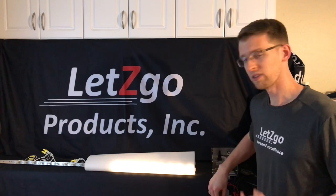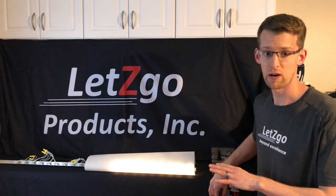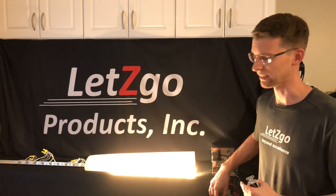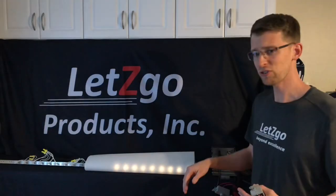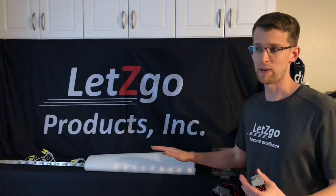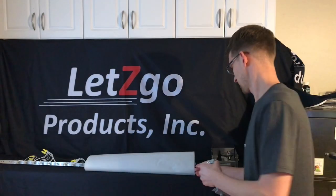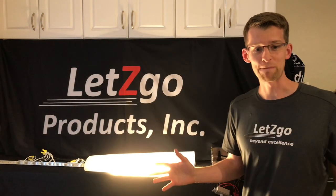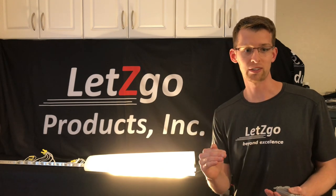When I turn these lamps up right now, there are nine of your standard average power factor lamps. As I turn this up, we're going to get to a point where you're going to see it start to blink. This is our overload indicator, so you know you have too much — too high of a peak current. When I unplug one of these lamps, all of a sudden that goes away, because we've got within the threshold that's acceptable.